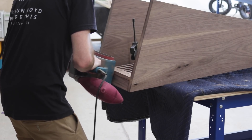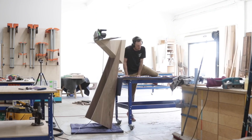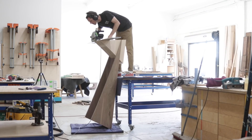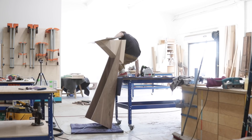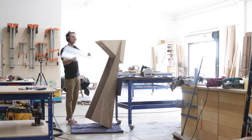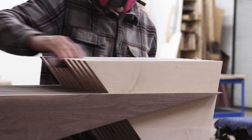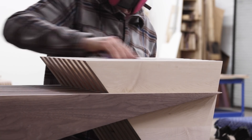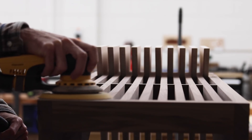Now that all of the parts had finally been combined to officially become a bench, I had a couple final details to take care of. I needed to trim the back cross piece to match the angle of the walnut side panels. The blade wasn't big enough to cut all the way through, so it took a quick cut with my track saw and a not-so-quick cut with a handsaw. Then I could sand that end piece flush with the side panels. I also needed to trim a small flat spot at the two points where the bench would be sitting on the ground, and I could do that with my track saw as well.